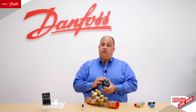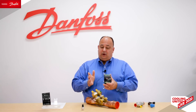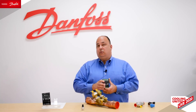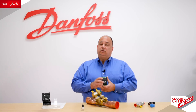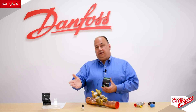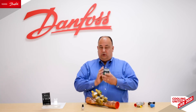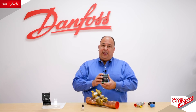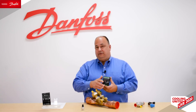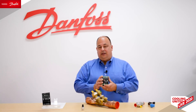All controllers come with the Danfoss MSS, or Minimum Stable Superheat, algorithms. These are learning algorithms that run continuously as the system operates, always maintaining the lowest possible superheat rather than a fixed setpoint. For example, a thermostatic valve set to 8°K superheat will always run at that point. With an electric valve using MSS, the system runs at whatever superheat is needed — perhaps 4 degrees, perhaps 12 degrees — to protect the compressor while giving you the best efficiency.